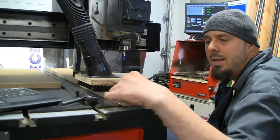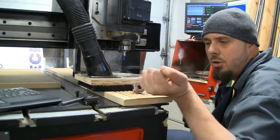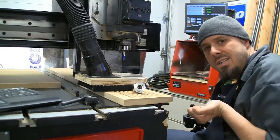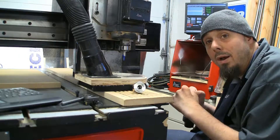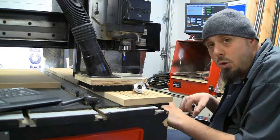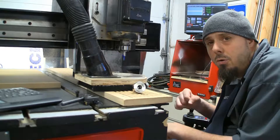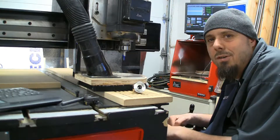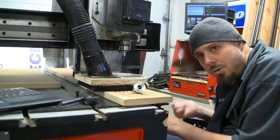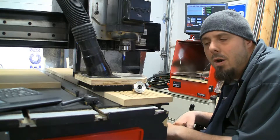And then it has what looks to be a set screw here in the side. But that set screw actually isn't just a set screw - it actually moves a little jam collar inside to suck against the side of the bit. And there's actually an O-ring in there. So you loosen it a quarter turn, pull your old tool out, put your new tool in. The O-ring just gives it enough resistance and friction to hold it. Then you do a quarter turn on the bolt and you're off and running again.